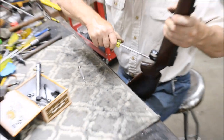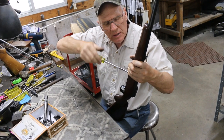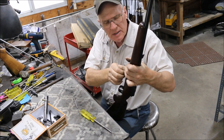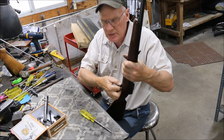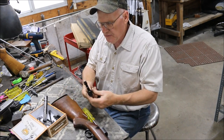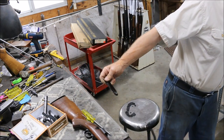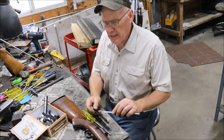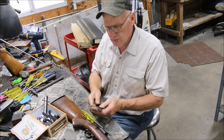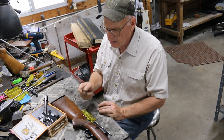On the Model 70s there are three screws. This is not a difficult gun to take apart — easy to put back together. We've removed the floor plate. The more I look at this and feel it, I believe it's an alloy. I'll step out of camera and check it with a magnet — no stick, so that's an alloy. Sometimes the floor plate is steel, but this whole thing is alloy. We're probably going to anodize it just to make it look right.